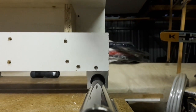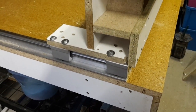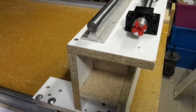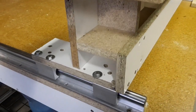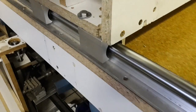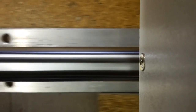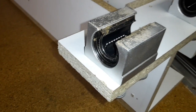Hello. I've been making this CNC machine today. I've made a box for the main platform and mounted some linear slides to it. They're about 1.4 meters long and I've put a gantry on those two slides — it's about 800mm wide. Overall I'm hoping to have a machine that can cut something within around the 1 meter by 500mm dimensions.